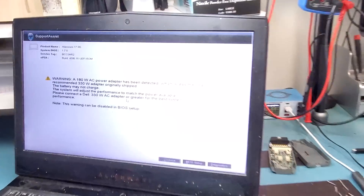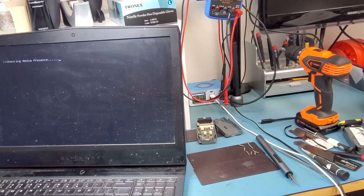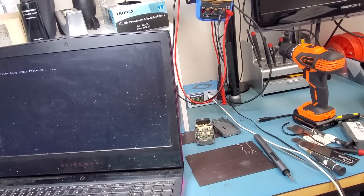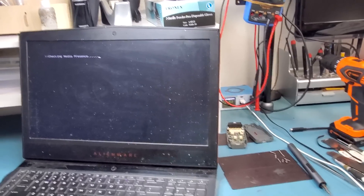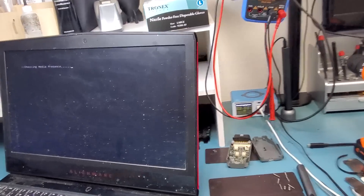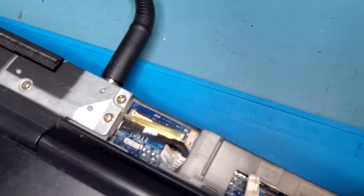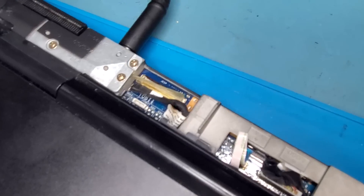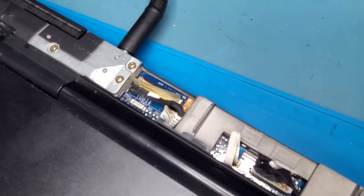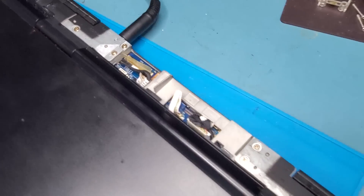The image came on the screen, and we do not hear that beep tone that happened before. So maybe that tone was happening because the screen was not being detected by the motherboard, but the laptop is working and the screen is outputting an image — awesome, amazing. We did an awesome job. The LVDS connector is on and the screen is connected. We do not have any side pads to secure that connector, but once we close the cover it's done. Customer has no business going in here, but if he has to, he needs to be careful when removing that connector. The job is done.